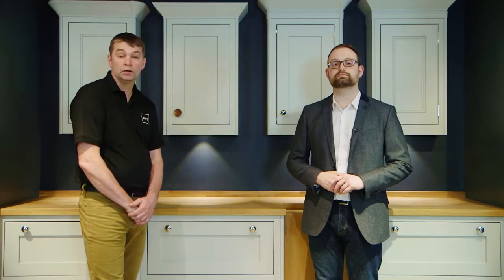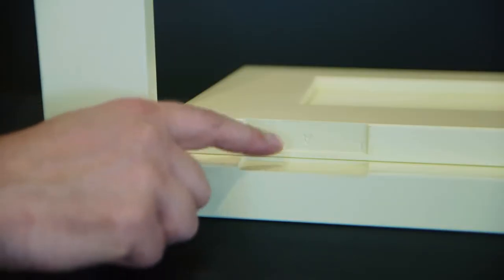This means all doors and frames are paired. You need to pick the handing of your door at the point of order. So you can tell which frame goes with which door, they are stamped inside the notch with a letter.